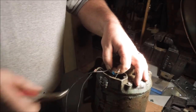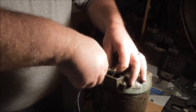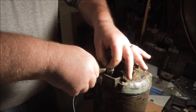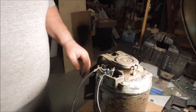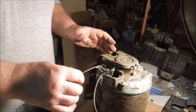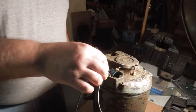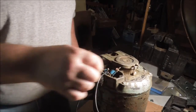The solder does have a tremendous amount of holding power on a wire, but you really want to make it so that the wire itself is mechanically attached. That way, when the solder flows into the joint, it fills the wire and makes it a very, very strong terminal — you won't be able to pull it apart. I'm going to unsolder that, then replace the insulation below that ring terminal with a piece of heat shrink tubing.